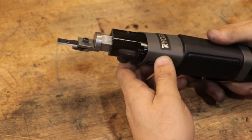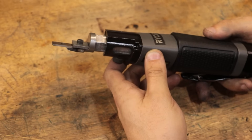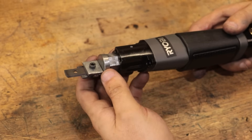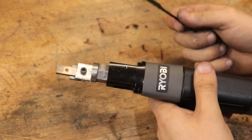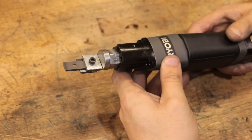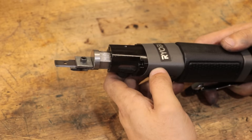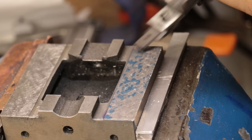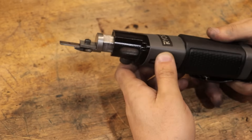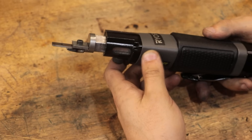I might need another pass or so to evenly distribute the contact points but so far I am pretty happy with it. In total this was less than five minutes of work — far quicker and easier than doing it the old way. Overall I am super happy with how this ended up compared to manually scraping and compared to how last week ended. This was far cheaper, far quicker, and far easier to design and make than the previous one, and once I finish scraping it's literally a two-minute job to change it back to use the old block and saw blades. The only caveat is to use this for smaller work pieces — a mill saddle is probably the largest piece I'd attempt before moving to a proper power scraper. But for scraping lathes, gibs, and vices this is definitely more than enough, and you'll definitely see this popping up in a future project. Thank you very much for watching, hope you enjoyed this video — see you next week.